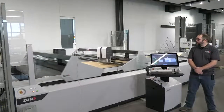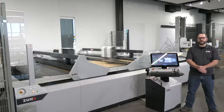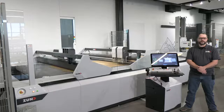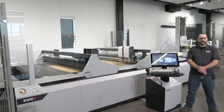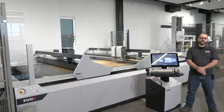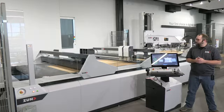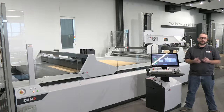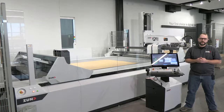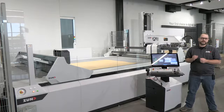The Q-Line is equipped with linear drive motors for frictionless motion and high-speed cutting with the same accuracy we would expect from our Gen 3 line of cutters. The machine is capable of cutting at 110 inches a second with 2.1 G's of acceleration. Our frame has been upgraded with a mineral cast base to eliminate unnecessary vibration and deliver a strong, robust platform for our tools. The beam is made out of a high-strength plastic with carbon fiber reinforcement to reduce weight while increasing stability.